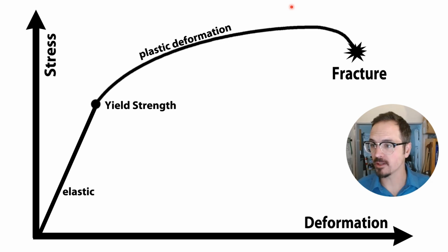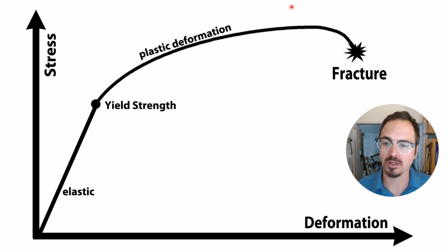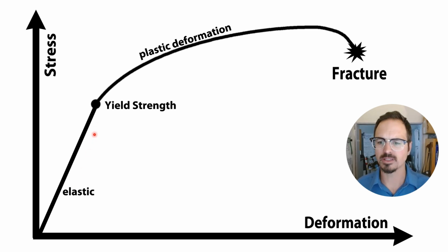All right, safety. Working on the press, working with all these different dies and materials, it's important to understand some basic material properties. Essentially, when you put any metal under stress, such as putting it in the hydraulic press and squishing it, it is first of all going to elastically deform. It's going to deform a slight bit and then bounce back. Once you reach the yield strength limit, you're going to get plastic deformation.